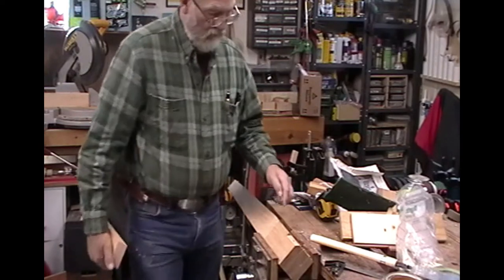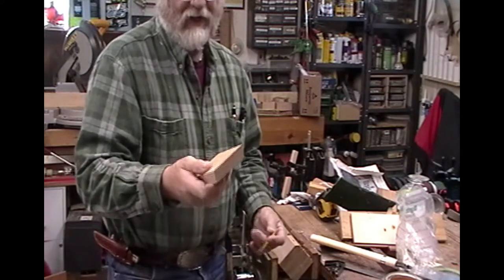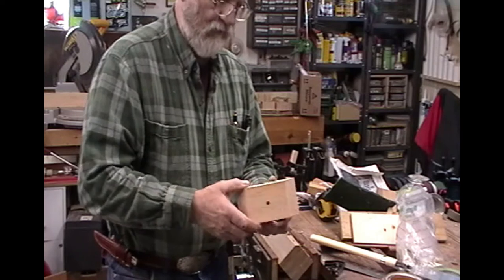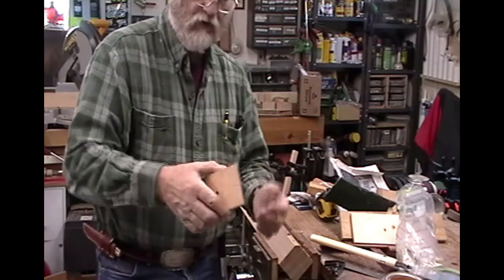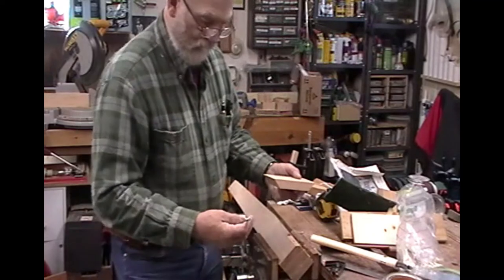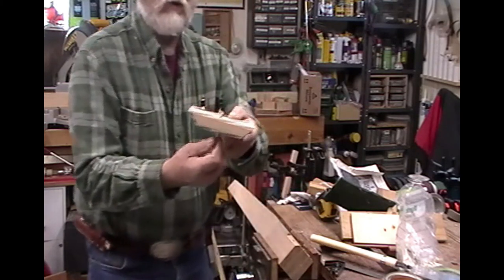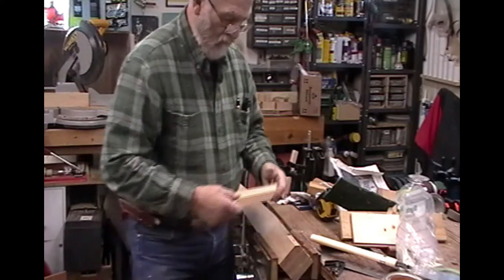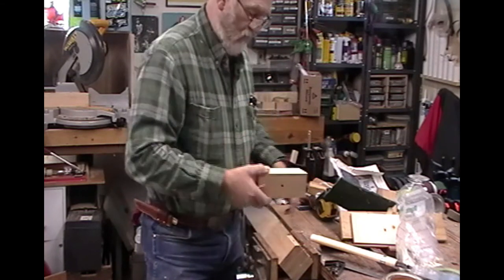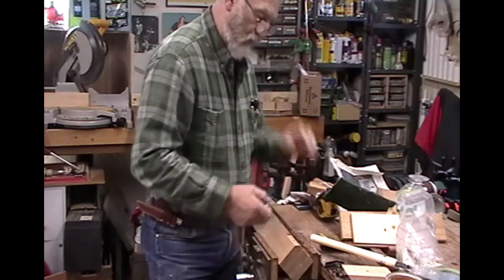Okay, so on the legs, to attach them in the corner, I'm using this cross piece. You can buy metal plates and all that good stuff, and I actually looked for some, couldn't find them, and so I went back to my old standby. I've done a few tables this way, and it's just a piece cut with two 45s, so it sits at an angle in the corner. I've got the hanger bolts that go through, and I cut this and drill my hole in the center, and then I lay this and the table leg up there, and mark it on the table leg so I've got a good lineup on my connection.